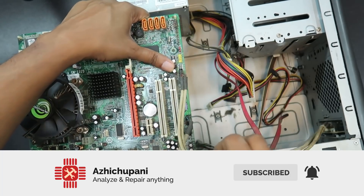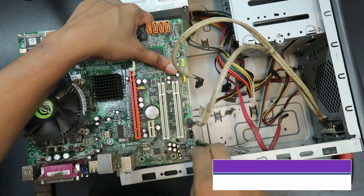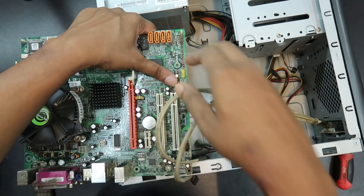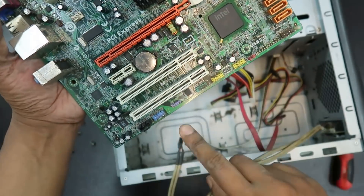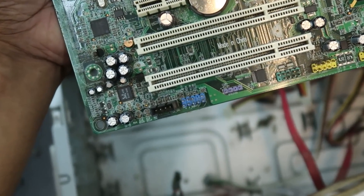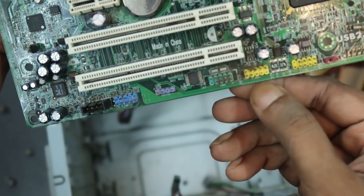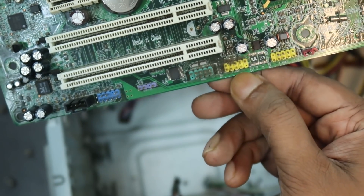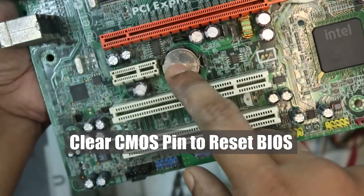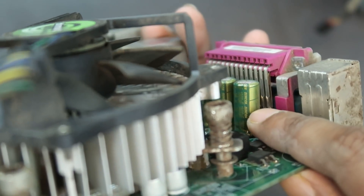This is a good thing. 2 wires are passed in front. We're already able to get audio — point of microphone and the audio headphone jack. We want to get front audio. This is the front audio. SP-DIF, COM-2, front USB-1 and front USB-2. Clear CMOS — this is the battery reset.